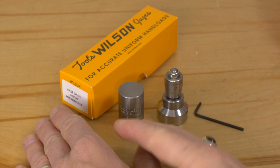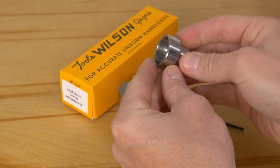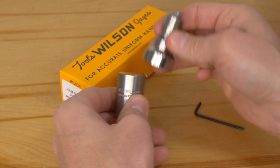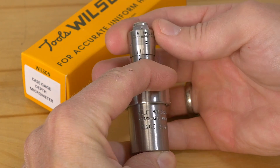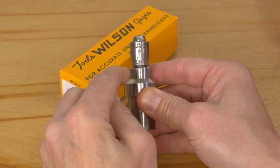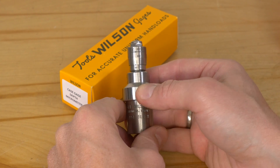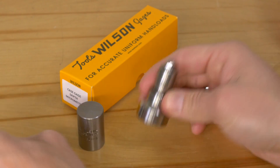Let's take an overview look at this new tool. What you get with the depth micrometer case gauge is the micrometer assembly itself, and the gauge block — which is essentially a high precision cylinder of steel that allows you to check your zero. When clamped down, it stops right at point one inch on the scale, which allows you to read a positive or negative headspace relative measurement. It also comes with an Allen key so that you can recalibrate your zero.